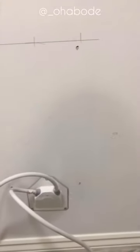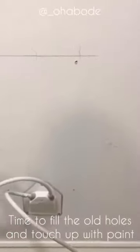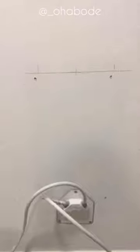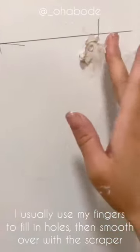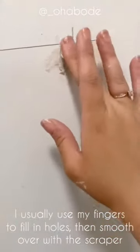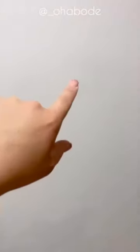There are a couple of holes from the old brackets, so I'm going to fill those with polyfiller and touch up any bits I won't be able to reach once the radiator is on — like this line they drew. I always use my fingers to push polyfiller in, it's much easier. I've filled the holes and painted — you can see the dark patches — and I've also painted around the area. The only marks left in the wall now are where I need to drill.